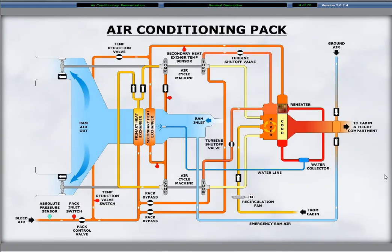The air conditioning pack functions as part of the environmental control system. Hot bleed air for the air conditioning pack comes from the engines, or the auxiliary power unit, called the APU, during ground operation. The air conditioning pack incorporates two air cycle machines, or ACMs. The pack uses an integrated single primary heat exchanger and a single secondary heat exchanger for the two ACMs. The design of two ACMs with a single heat exchanger provides a much larger heat exchanger when only one ACM is operating.